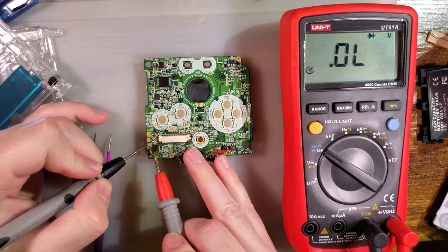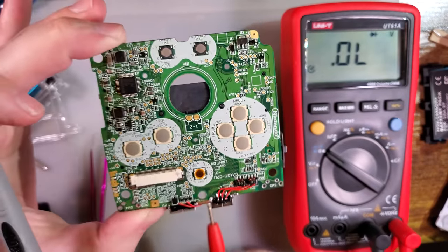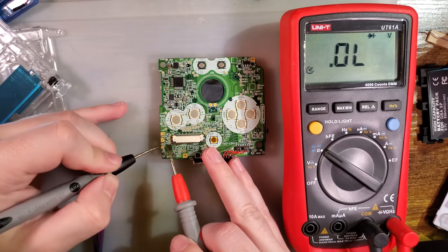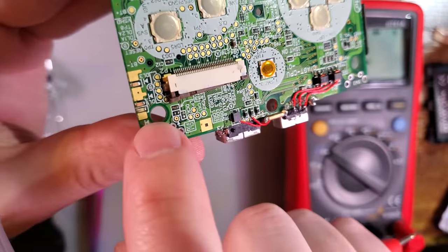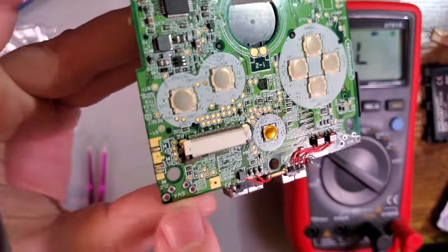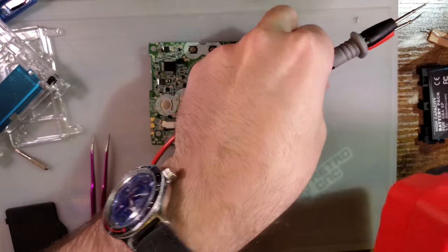The reason we do this is so that we can determine what the polarity of the LED is. We can see that the outside pin or pad is the ground pad on the SP. You can also tell that just by looking at the little icon right there, but not every board is as helpfully labeled as Game Boy boards are.